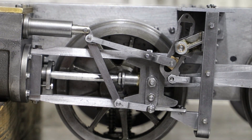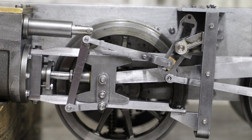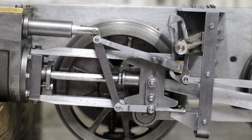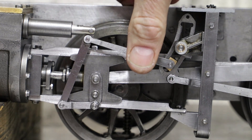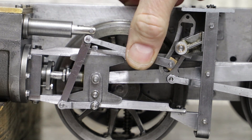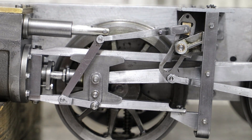With the cylinders now sealed up the next job is to assemble the steam chests along with their associated gaskets, but I'll cover that off in the next video. I'll finish this one with a view of the left hand valve gear as I rotate the wheels. As can be seen from the radius rod in the expansion link, I do need to complete the linkage through from the reverser and then I should be very close to running on air.